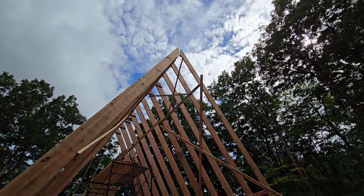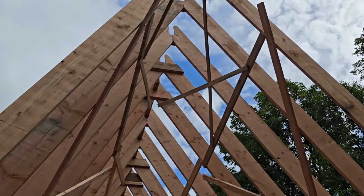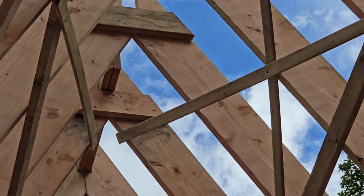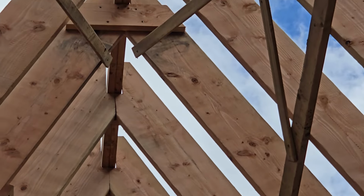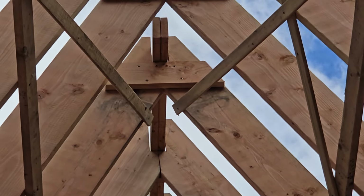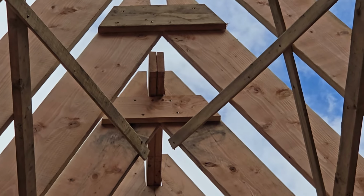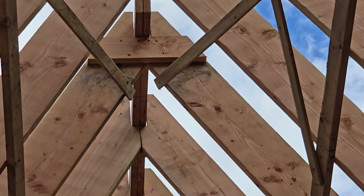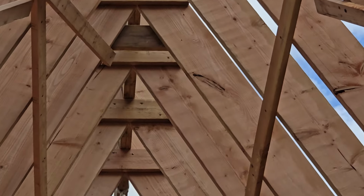And you can see, okay, if I get under here, I'll zoom them in. There's little gusset blocks that you can see up there. Those link the ends of the rafters. They were sitting against the ridge up there. And then, because the ridge is going to be moved along, we put these gussets there that would support the ridge, and they link the 2 rafters. Now the rafters push against each other, which stabilizes them, and at the bottom they're tied in.